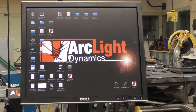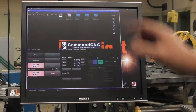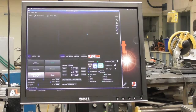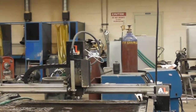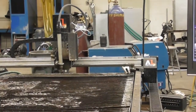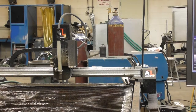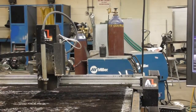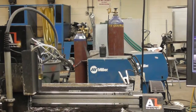When we get ready to run the machine, I'm going to show you how to run Inkscape, Sheetcam, and Plasma. We'll take them in that order, but since I'm showing you how to turn on the machine, I'm going to start with Plasma — just double-clicking on it. You hear it activate the machine. I hit the e-stop, then I hit Shift and Page Up. If I hit Shift and Page Down, you can see it goes down; Shift and Page Up, it goes to the top. Shift and the down arrow brings it towards me. If I do not hit Shift, it goes into jog speed, which is much slower — that's the cutting speed.